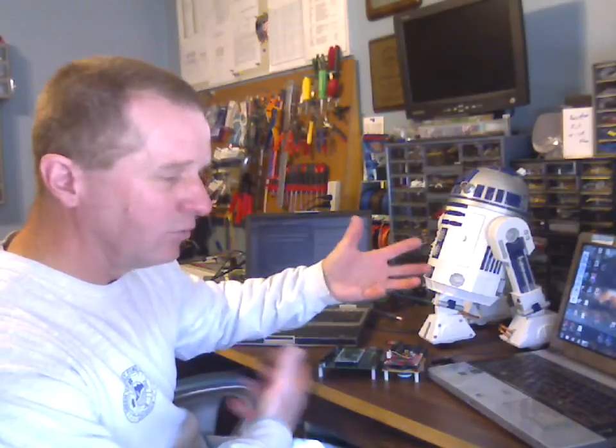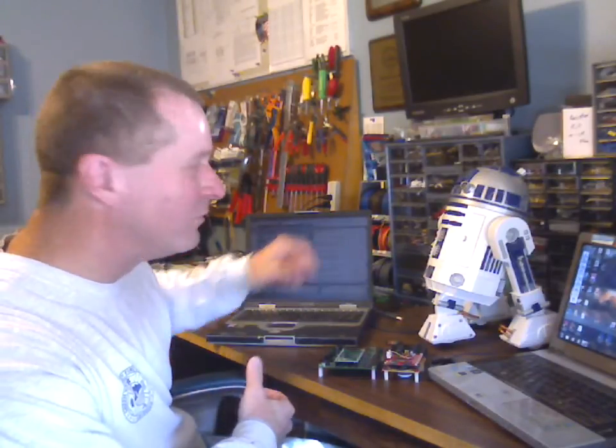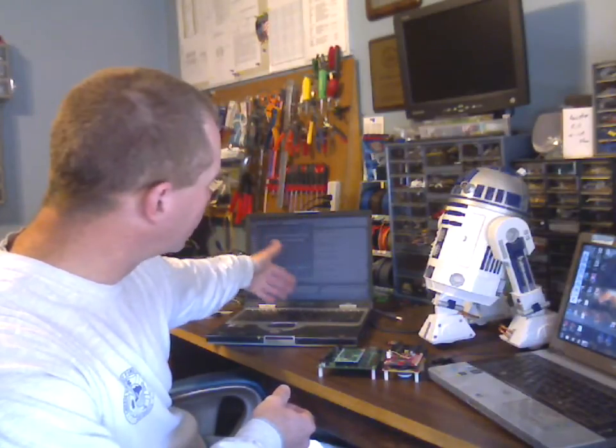The challenge I had was the menu for the Do You Remember game, where you say 'Do You Remember' and then a character's name from Star Wars, and R2 gives a different response depending on what the name is. Most of those names are very uncommon and not the kind of things the text-to-speaker-independent system could intuitively interpret. So I had to go in manually and code the phonetic sounds for each individual syllable of those names. They do have a provision for that, and then it allows you to test the commands on a computer-based simulator using the computer's microphone and fine-tune them until they're to your liking.